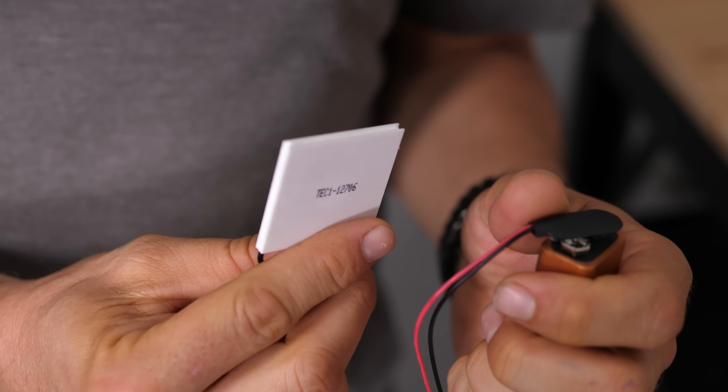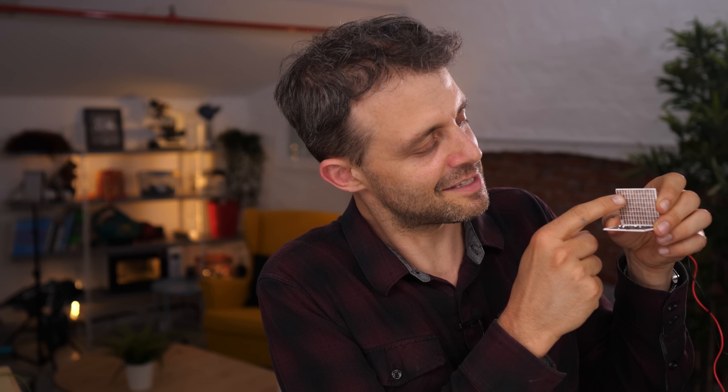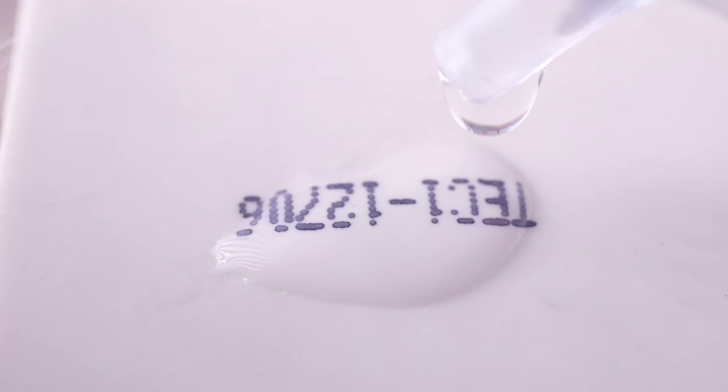If you make use of the Peltier effect in a device, it's called a Peltier element. If I connect these two wires to a 9-volt battery, one side gets really hot and the other side gets really cold. I pulled one apart so you can see what's inside — there's a whole load of thermocouples all in series with each other, and it's actually different semiconductors used here as opposed to different metals. With a heat sink and a water bath, you can even use a Peltier element to freeze water. ElectroBoom made a video about Peltier elements worth a watch, and AlphaPhoenix is using Peltier elements in an upcoming video where he's trying to grow huge single crystals of water — so subscribe to AlphaPhoenix. I'll leave a link to their channel in the description and on the end screen.